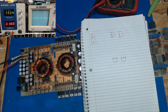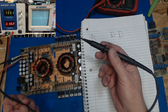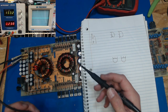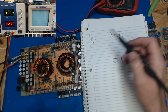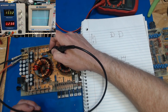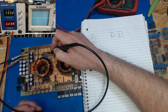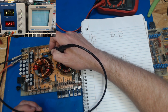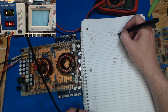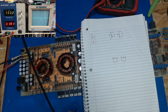All right. So the first thing I want to do, without even going back to the chip, is take my oscilloscope, which you can see up here, power this board up, and probe each of these legs. Nothing, nothing. Oh, there's drive, nothing, and positive. Okay, so we've got drive here, so that's got to be a base, and we've got positive right there.